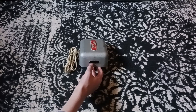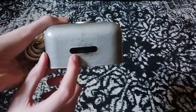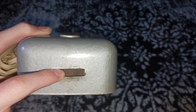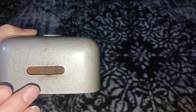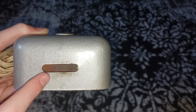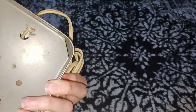As you can see on the bottom, there's a little what would look like a smoke vent for smoke to enter, if this was a smoke detector. But since it's a heat detector, it actually has a little metal rod — there you go — a little metal rod that, when heat touches it, it'll contract and touch another little metal disc down there, which I presume is hooked to the two vibratory discs, which actually are here.